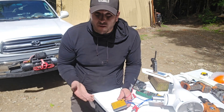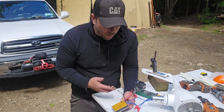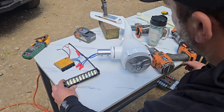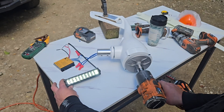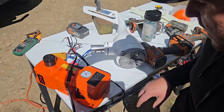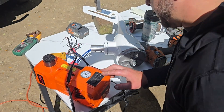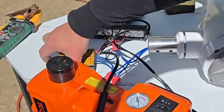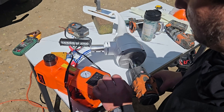I would highly recommend running it at 24 volts but with a better regulator rectifier - maybe ditch this one and buy a better charge controller, or if you're savvy in electronics, build your own full bridge rectifier with a better voltage regulator. Just for fun, I hooked this little 30-watt LED light directly to it - I wouldn't advise this; it'll probably burn out the light. But wow, at barely any RPMs it powers it and it's very bright. Now I'm going to try a Temu electric hydraulic car jack and air compressor that pulls 120 watts.